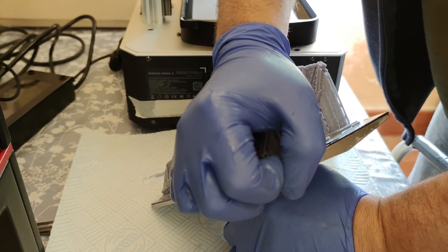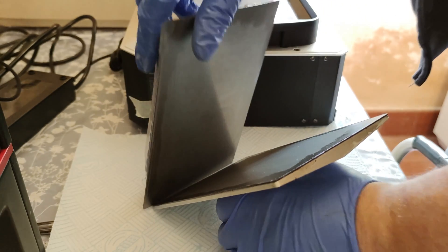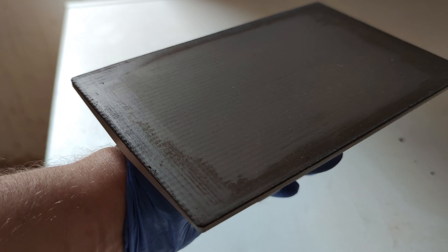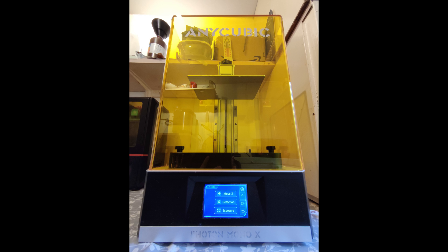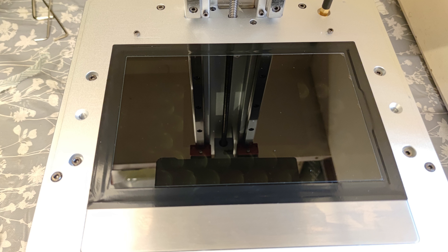However, things are not perfect. After removing the build plate, I realised that the NeoFlex magnet started to look a little rough around the edges. I think the rubber may be reacting to the solvents in the resin, and this might be breaking down the medium that the magnet is held in. I'm going to keep an eye on this, and I may need to look at a way of sealing it and protecting it from the resin. But for now it seems to be working. So there we have it — two upgrades I did for my large resin printer. One of these I highly recommend everyone does if they own one of these large format printers: get the tempered glass screen protector. It really is a no-brainer. Now that these are readily available, no one has any excuse not to. If I had any gripe about the screen protector offered, it's that it's cut to size to just cover the polariser portion of the display within the black tape, where I would have preferred the glass to reach the ends of the LCD panel with the black tape placed over the screen protector, sealing the panel better from any spillage. But what we have now is still better than nothing at all.